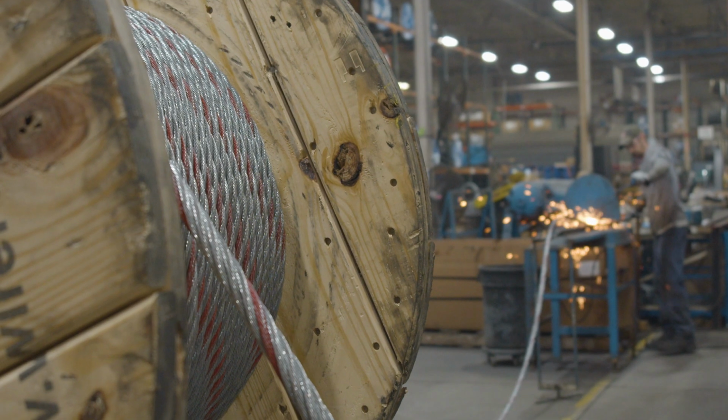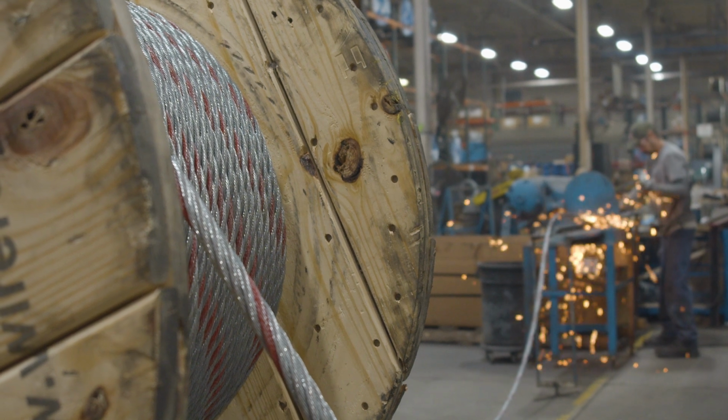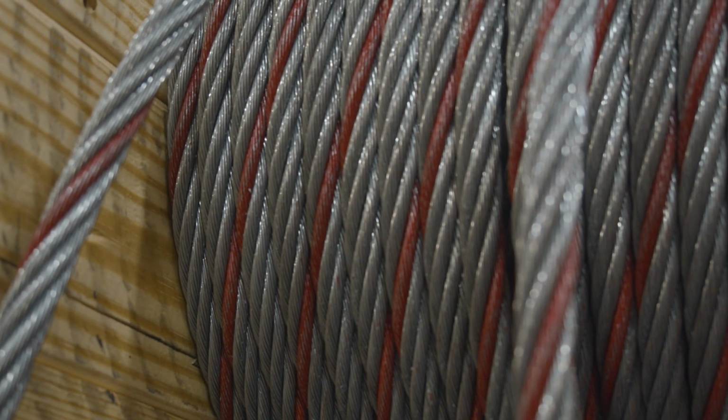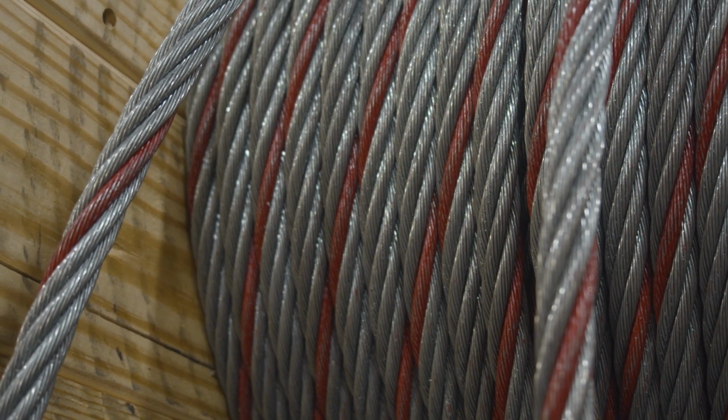So with domestic wire rope brands, the way to identify the colored strand is essentially by looking at it. And this really is with general purpose wire rope. So the 6x19 class and the 6x36 class of wire rope will have 6 strands, right? 6 being how many strands are in that general purpose wire rope. 1 or even 2 of those strands could have a colored marking, which would then identify the manufacturer of that wire rope. A lot of US companies use color coding systems. They started doing this in the 80s mainly to promote traceability as non-domestic manufacturers became more predominant in wire rope.